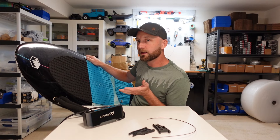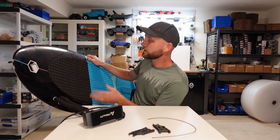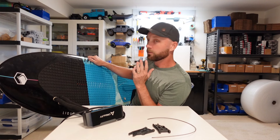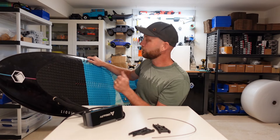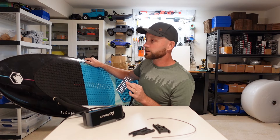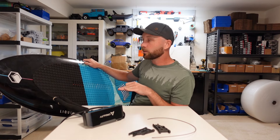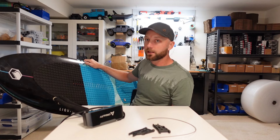I've been playing around with it a little bit already and haven't had any successful scans yet. I've been trying different tracking methods. The default is geometry-based tracking, but because this piece is so long you can't scan it all at once, and when you move from one section to another there's no massive change in geometry, so tracking is a problem. I had a little more success with pattern-based tracking and was actually able to create a scan, but when I wrapped around to the other side of the board it didn't mesh perfectly. So I'm going to try using these tracking dots — placing them all over the board at about 20cm intervals. I'm hoping we can get a complete scan when moving from the top to the back of the board. Otherwise, I'll scan each half separately and find a way to merge them later.